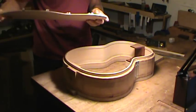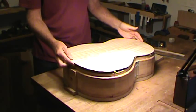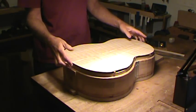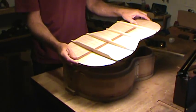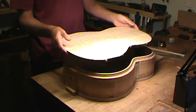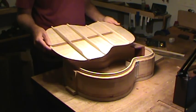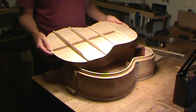So that's pretty much it. The foot is ready to go — I'm ready to set the back on here, mark for all of the braces, mortise the braces, and then do the final fitting. At that point I'll mark where the back strip butts to here and here, these get cut off, the whole thing gets fitted in and clamped up. Maybe in the next video I'll show you how I do all that. Until then, thanks for watching and we'll see you next time.